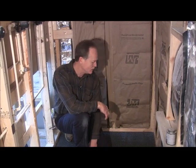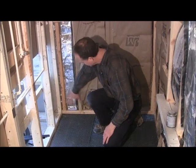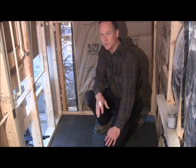All right, we've got all our metal lath in now. Something I want to point out, you can take a felt tip marker and mark your line. It'll chew up a felt tip marker pretty quick though, but you can use one. Something else I want to point out is some people will tell you to put blocks inside here, like a 2x10 blocking. And I'll show you why I don't do that.